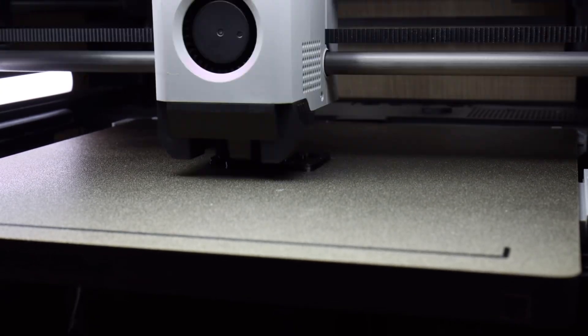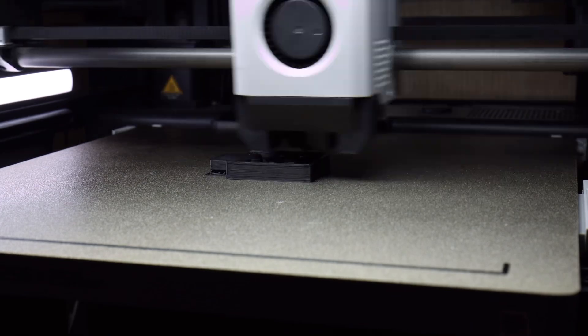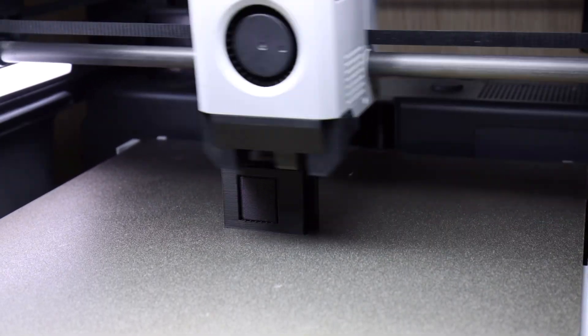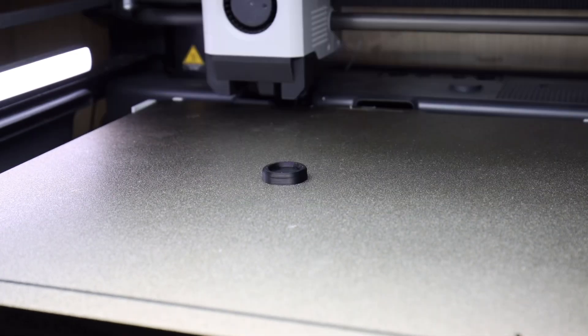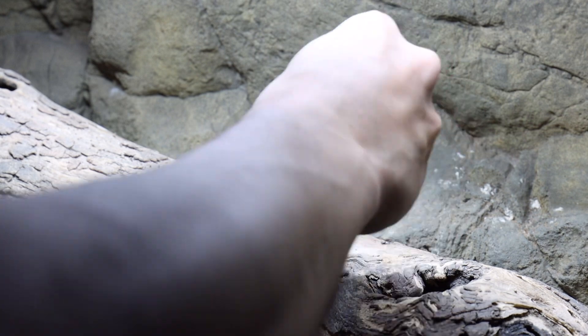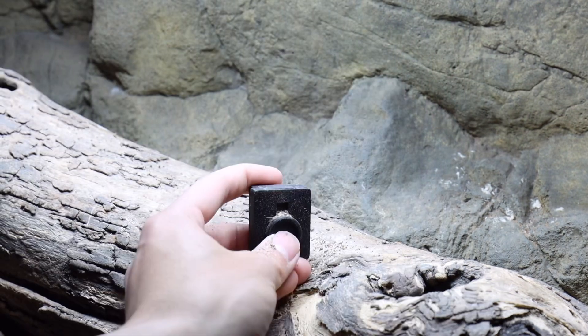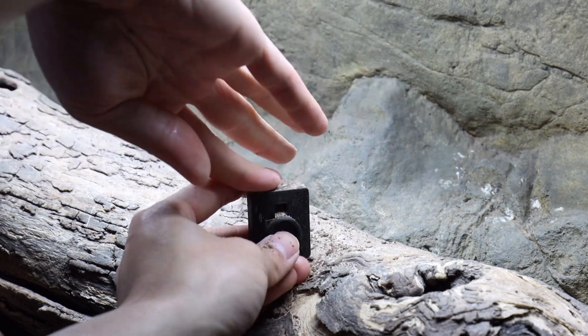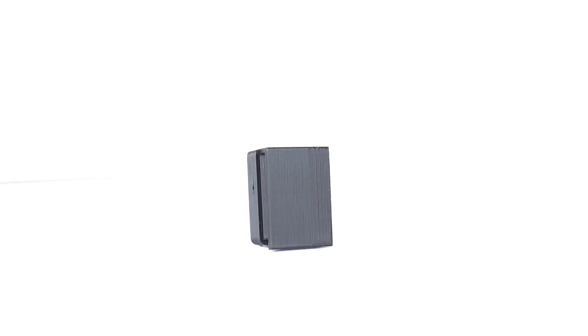I finished up drawing the casing that holds the mechanism, the clip that attaches to the enclosure, and buttons for ergonomics. Another issue I had with the original lock and my first design was that sand and substrate forced into the lock would jam it up, so I incorporated a window in the back of the lock that allows substrate and sand to be ejected.